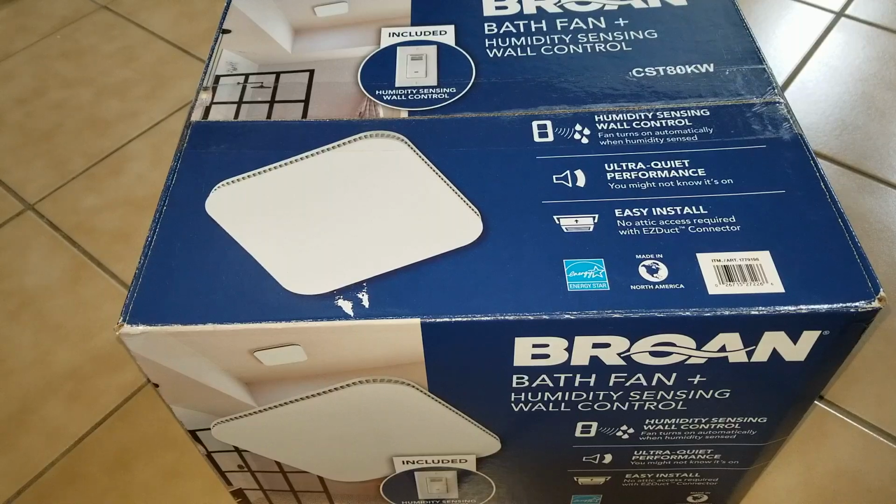Energy Star certified. 4-inch duct connector with damper. Fits 2-inch by 6-inch ceiling construction. UL listed for use in insulated ceilings, Type IC, and HVI-2100 certified for safety. UL listed for use over bathtubs or showers when connected to a GFCI protected branch circuit, not included. The product dimensions are 12.25 inch length by 12.25 inch width by 5.75 inch height, and the weight is about 9 pounds.